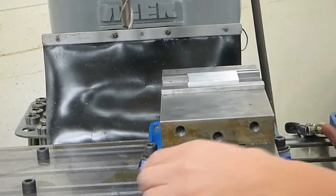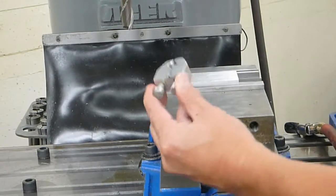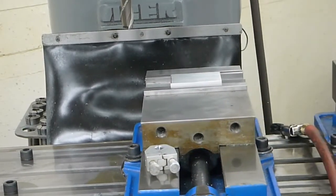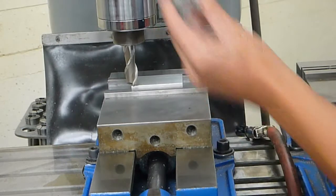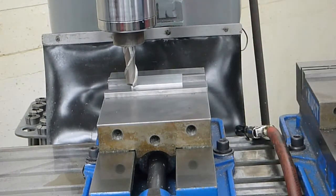Move the hammer. Then we're going to move the mill in position, and again I'm going to use the quill stop for the quill itself. And then bring it down close to the material, but not touching. Put the quill stop in place. Bring it down until it's against the quill stop. Tighten the quill. And then we're going to turn on the machine.